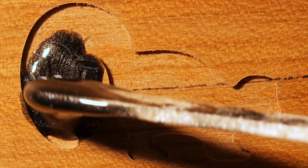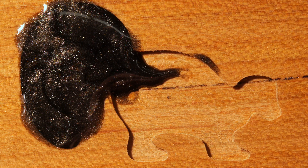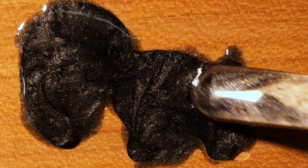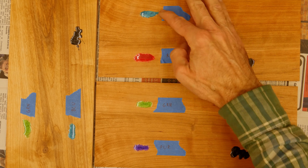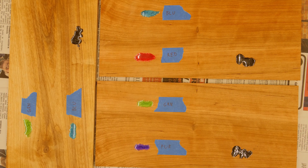I mixed up a little bit of red pigment into some epoxy and used quite a bit more mica powder - a higher percentage than when I was doing the inlay on the other side. I can tell I went heavy on the mica because I want this to stand out a little bit more. I'm going to stipple it in with this brush, since there are probably bubbles down in the text - hopefully that'll get the air out of those pockets. To inlay the skunks I'm using a pigment called Onyx. It's not a solid black - it's got some highlights in it which I think is going to look nice, giving it a little more texture than just a solid black field. For each board I've inlaid the colored text for start and finish and the outer pocket of the black skunk, then giving them a quick shot with a propane torch to help release bubbles.